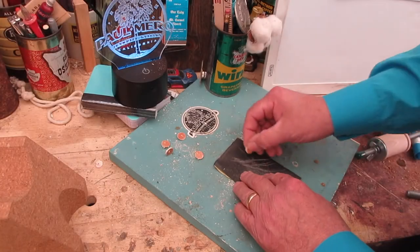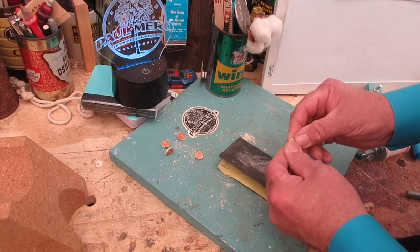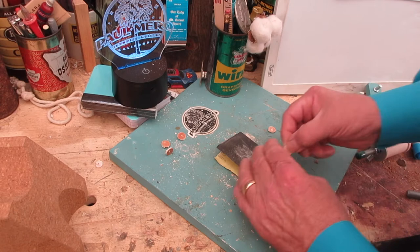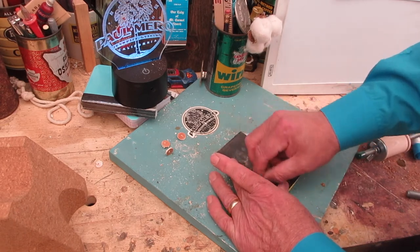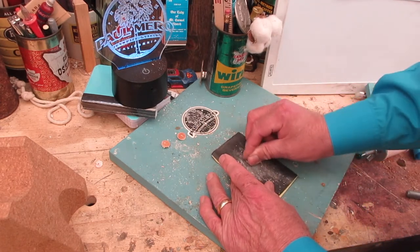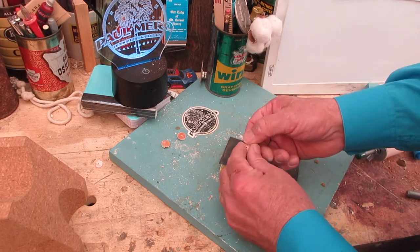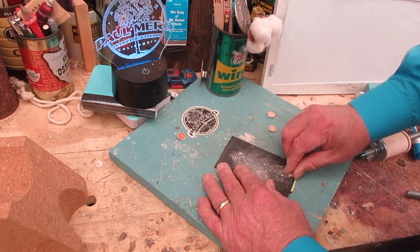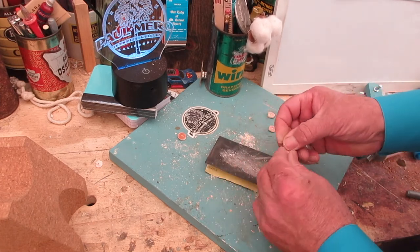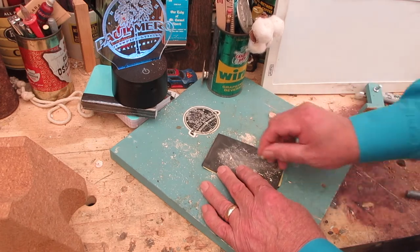I've got my plug. The last thing I'll do is make sure the side that goes toward the guitar and everything around it doesn't have any big jagged edges sticking out — if it does it won't be effective. Any sheen on it needs to go too, because I need the glue to stick. Basically feel and make sure your plugs don't have jagged edges that could cause a gap between the guitar body and the plug. Some 220-grit and a couple minutes and you're good.